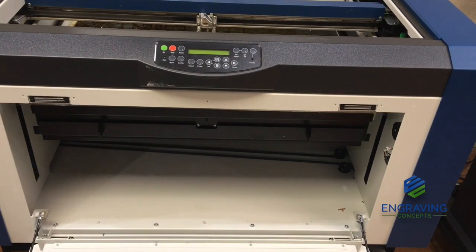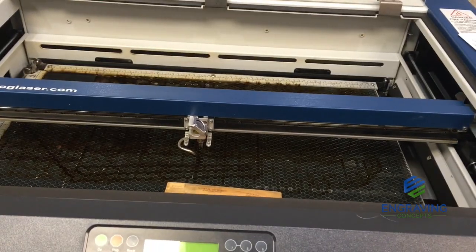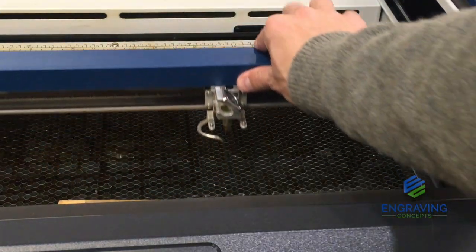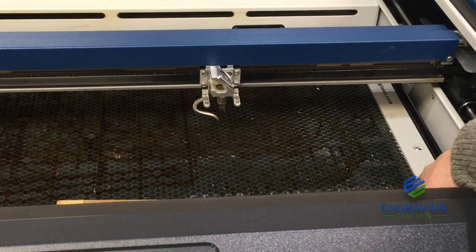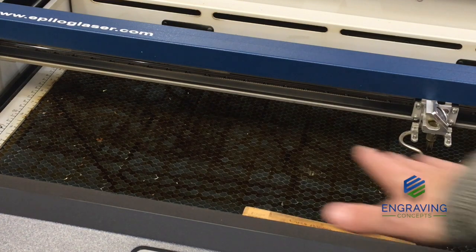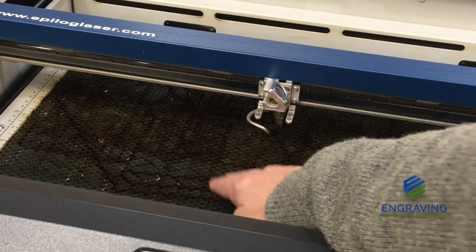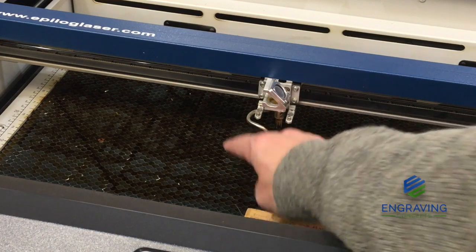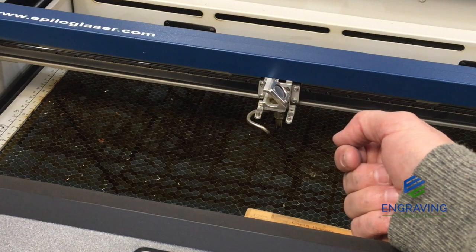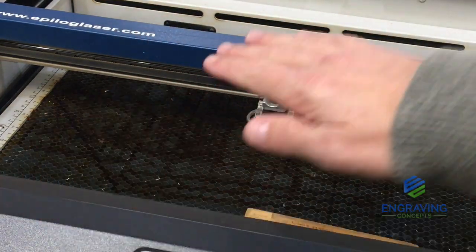Verify that there's no more collision, then close the front door. With the machine powered off, you can take the carriage and move it left and right. Make sure to flip the rulers down, then you can turn on the machine — but be sure there is no collision anywhere, no material, and that the plunger is not stuck inside the table. If you push stop and reset while the plunger is still inside or close to the grid, you risk the table trying to finish the focus and dragging back across the grid table. To get out of that situation: power off the unit, open the front door, and pull the belt to lower the table down.